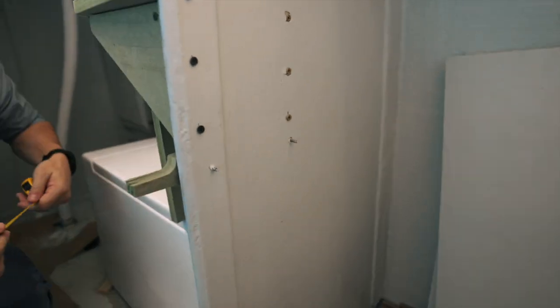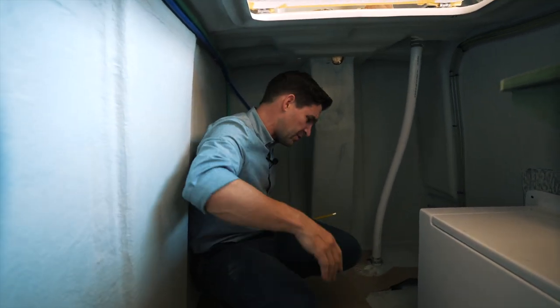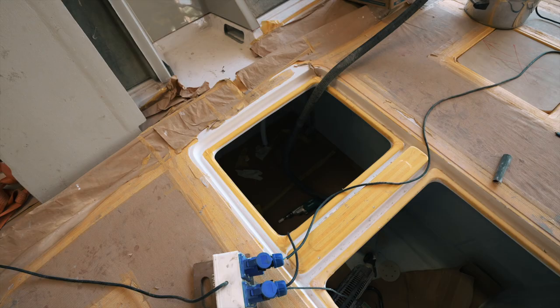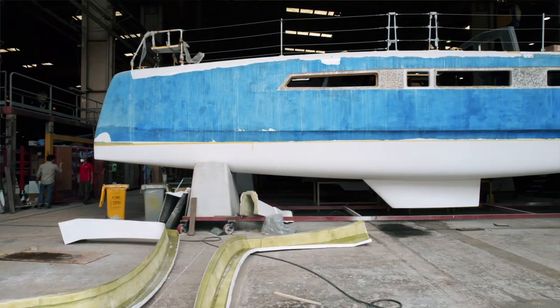The forward part of this locker is 800 millimetres. We've got a removable panel which we can put across here if needed, but if people want to remove it, this is a great location to put anything heavy or anything long - you can put kiteboards or a surfboard in here pretty easily. But please, can I overemphasise to everyone watching: if you weigh this boat down with heavy, dense things, your boat is going to sail like a dog. As a boat builder it's great that we can do this, but it makes me nervous that people will put too much inside.